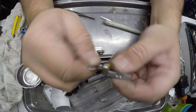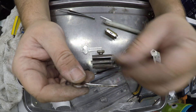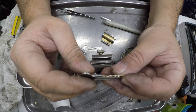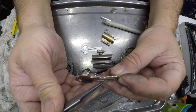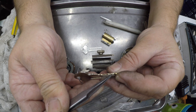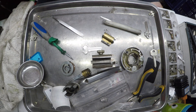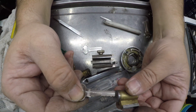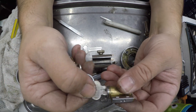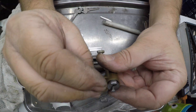The next trick is we're going to turn it a bit — it's not clicky at all but it is a little bit tight on those pins. By having a look at my key now, I can definitely see an impressioning mark on the second. Third is okay, fourth is okay, fifth is okay. So definitely the second needs to lose a little bit of meat. The second has now lost a little bit of meat — all our ramps are good, in and out is good, and now there's no resistance whatsoever.